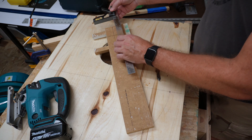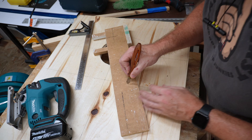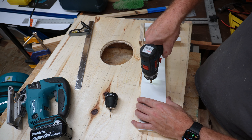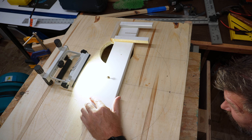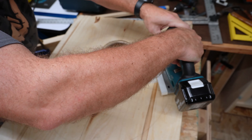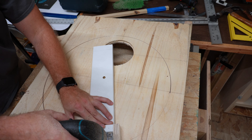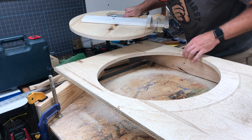So now with our jig made, we can go ahead and cut out our circle. You can use this jig to cut any size circle. Since we're looking for a 20-inch circle, we're going to be placing the screw into the jig 10 inches away from the blade. I like to get the screw started so I can actually see it and then line it up with the mark that I made earlier. This is actually pretty important to get the circle centered on the board. The jig will keep it perfectly straight — just make sure to keep all your pressure down and forward. If your jig is long enough, the screw in the center will actually keep the circle from falling in once it's cut. Mine wasn't quite long enough, so I grabbed the target hole before finishing the cut.